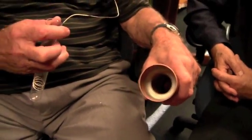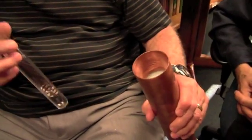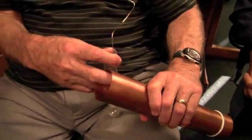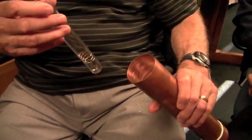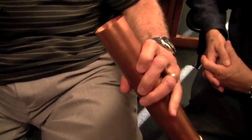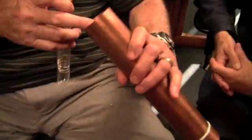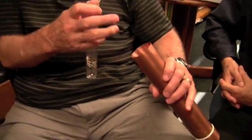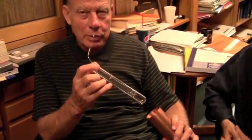Copper is one of the best conductors of heat, so you have good heat conduction — except the heat has to go through the insulation, and that retards it, which allows you to make bigger temperature differences. It's just a copper tube inside a copper tube. The insulation — he did some with foam and some with sawdust, since he was working with a lot of wood up in Oregon. The sawdust actually gives you a little better results — better insulation than the foam.